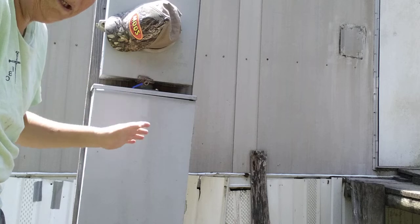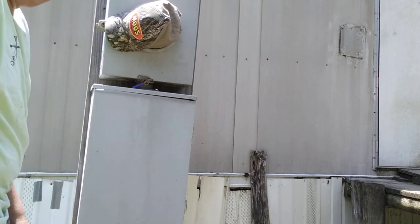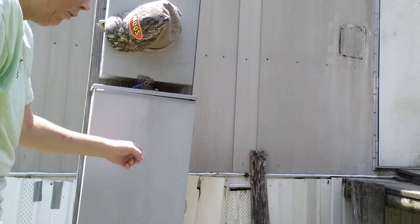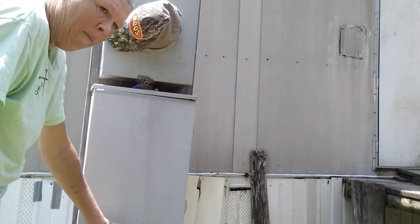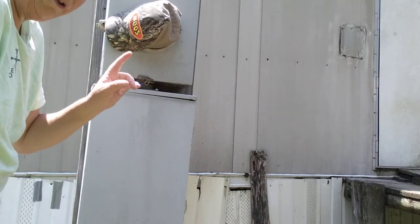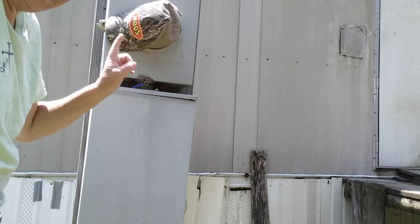It's a short video — it's a hundred million degrees out here and I'm sweating profusely. But if you have a breaker box under your meter box, and if you want to, call your power company and just ask them if it's okay. This is my end — the part coming down is the outbound power company's part, and this is my part. So I can lock this, I can put a lock on this right here, and that takes away one of those worries when the power goes out. Is somebody cutting my power, or did the power actually go out? If I know I've got a lock on this box, I know the power is actually out.